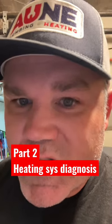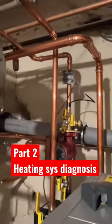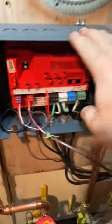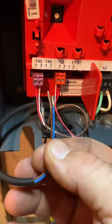That is a temperature sensor strapped onto the pipe after the pump, from the supply to the mixed circuit. This is the control that controls not only the mixing valve motor and that pump — it also takes input right here from the mixing or the supply sensor.